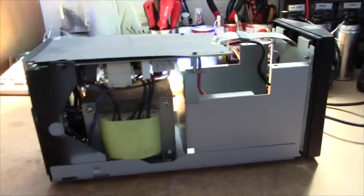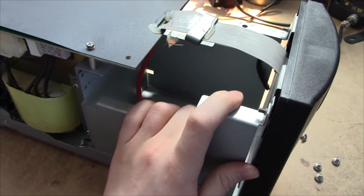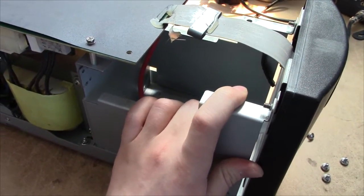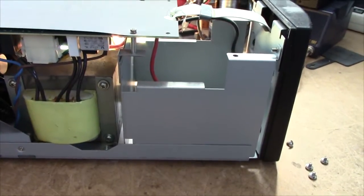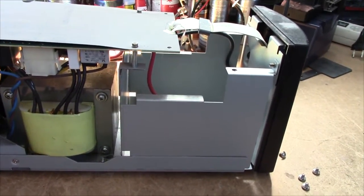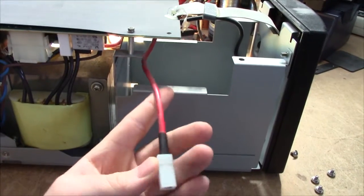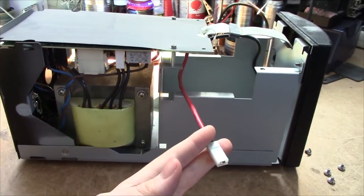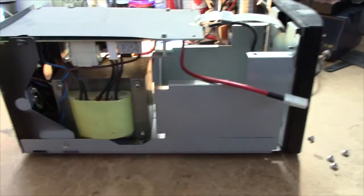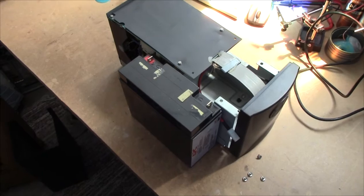So what do we have? First, battery compartment. This thing came with 2 7 amp hour batteries, factory installed, which, well, you just don't run a 2 kVA UPS on 2 7 amp hour batteries. And trying to draw that much current through these thin little wires is just a suicide mission. For example, an APC 2.2 kVA unit runs on 4 17 amp hour batteries in series for a 48 volt system, and there's a single 17 amp hour battery. You couldn't even fit it inside this unit.